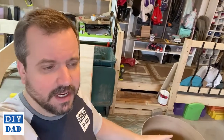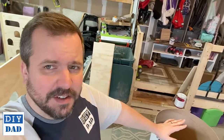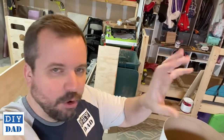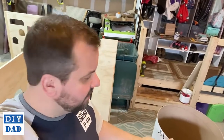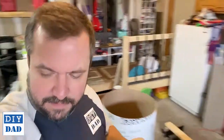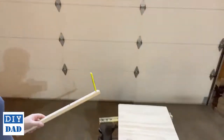So what I ended up doing at my store is going through and pulling off about 20 of these off the racks and finding 3 that were from the same portion of that process, the same width. That puts mine at about 15 3/8 of an inch wide. So 16 inches is really 15 3/8. What I've then done is I've used the same tool that I used before, so my little compass basically, and I've measured this at 7 11/16, which puts me at 15 3/8 for my diameter.